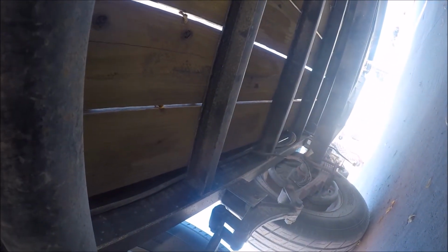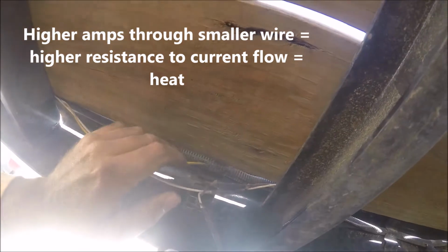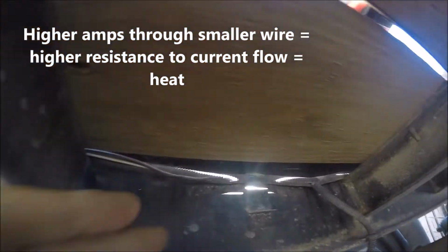But you can see here where it all melted, actually melted the wire loom further up. And you can see where the wires are hanging out of the wire loom because the wire loom actually melted from the brown marker light wire being grounded to the frame. It was just sucking power, like you can imagine it was. And so it melted all this. So anyway, I'll pull this all away. I'll get the fenders welded on, I'll get my other pieces welded on, and then I'll get this put back in place. But so they did a pretty good job in here, I think.